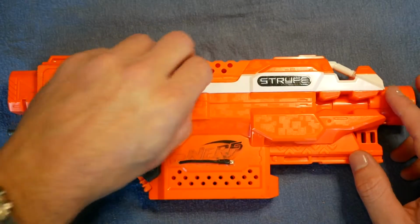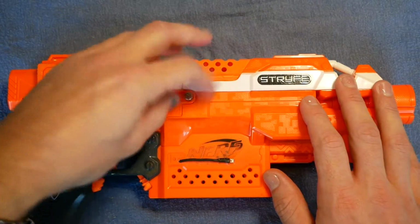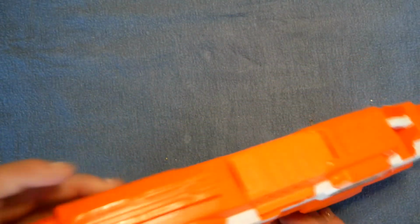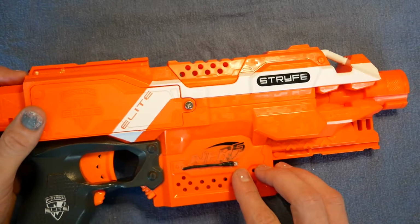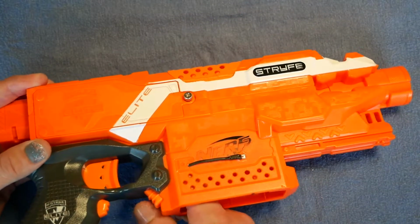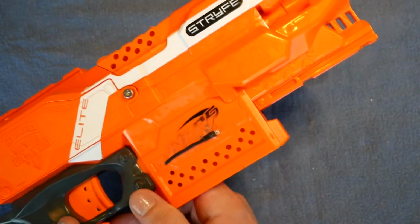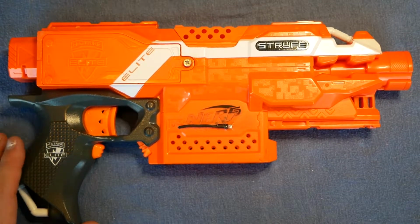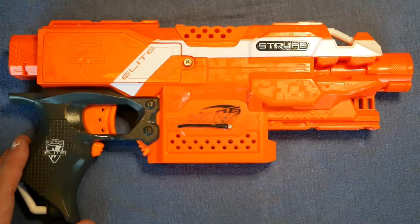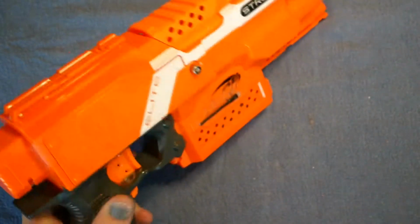Epoxy putty. And this is running off 3 IMRs and through a custom circuit board that's got this plus MOSFET for the motors. And this transmitter plus the reload light back here, that part of the circuit's only active when the magazine switch is pressed on the inside, so you can save power just by dropping the mag out. If one wanted to have a magazine in for extended periods of time, like if this was your secondary for HVZ, then you would probably want to wire it into the rev switch, so you only get a reload warning when you are revving rather than any time there's a magazine in.